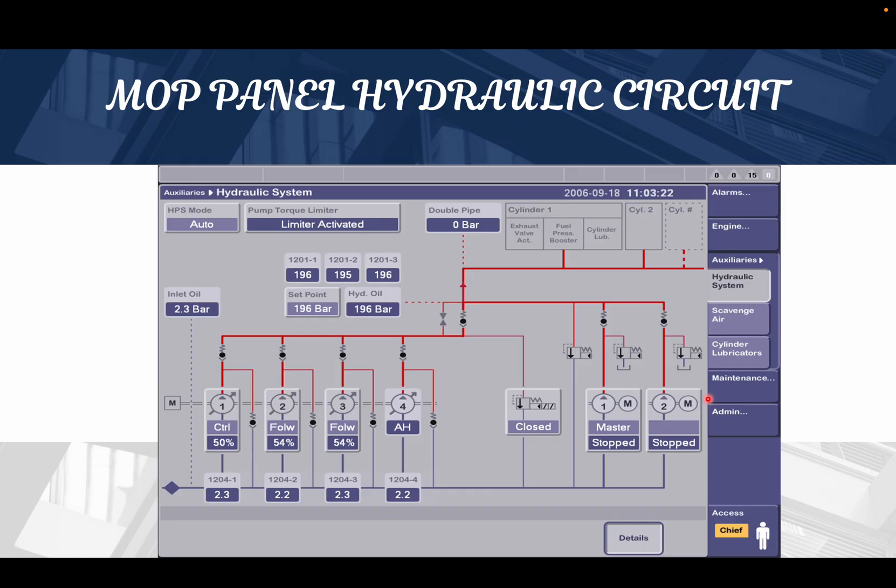After 15% of MCR, the engine-driven pump takes over to further increase the RPM. There is also a bypass valve provided for a specific purpose. This bypass valve needs to be tested every three to six months depending on your engine type, and is tested when the engine is in the stop condition. During normal operation, this bypass valve is in the closed position. It is provided for the scenario of a blackout — when there is a blackout, the luboil pump pressure on the suction side will be zero.